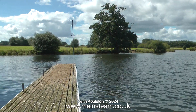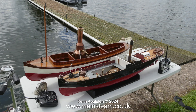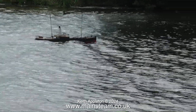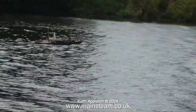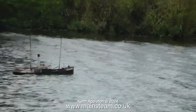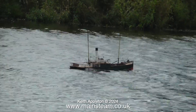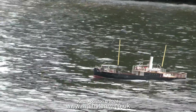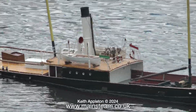I refurbished these steamboats a while back and we've had to wait quite a long time before we could sail them, owing to the great age of the owner of the boats, and the fact that the weather had to be at least somewhere near respectable. But today wasn't too hot, it was not raining for a change, but it was very windy. The metal boat is very heavy indeed and it sits very low in the water, particularly at the stern. So after the first circuit of the lake with the stern almost under the water, we brought the boat in and added some ballast in the bow, which levelled it up a bit. It's almost a two man lift — I thought it was going to do a Titanic, but no it didn't, it sailed very well. In this close up you can really see how low the stern of the boat is in the water, and this is when we were bringing the boat in to add some more ballast to the bow.